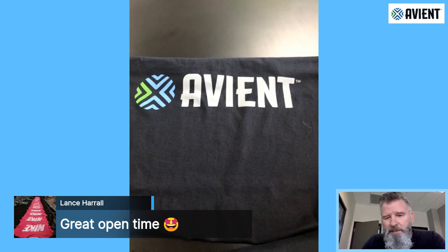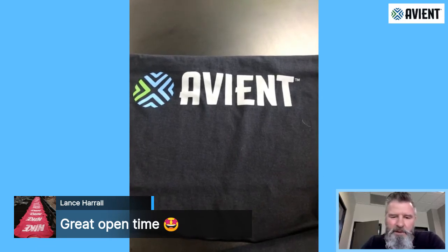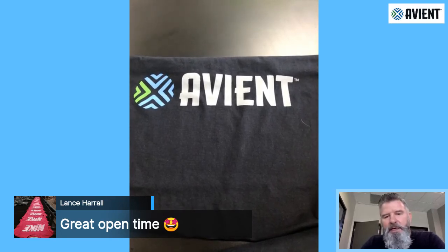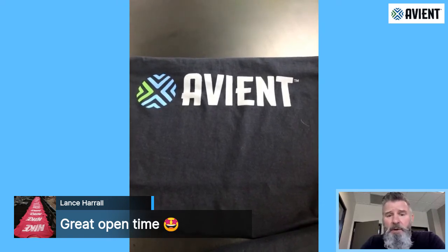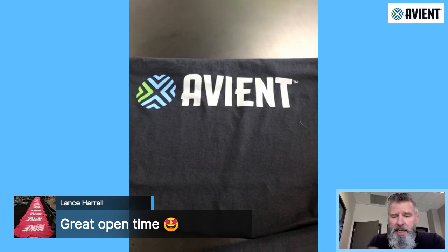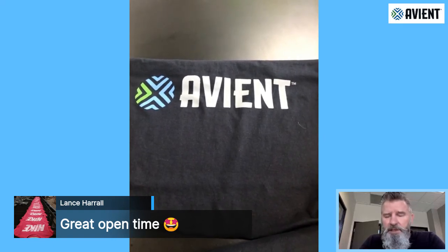Like if you're in Vegas or in Phoenix, it might take maybe 5 strokes to get it going again. Just throw on some scrap garments, get it going, and then start running again when you're back from lunch. At night, you do have to pull it out if you're going to be gone all night, and wipe out the image area. If you are breaking for more than 30, 40 minutes, just to be safe, you can strike back and just wash the image area out. Leave the image clean as you're gone. And when you come back, it'll be a very easy startup.